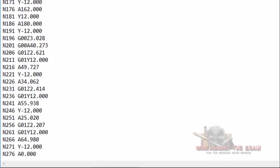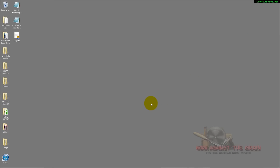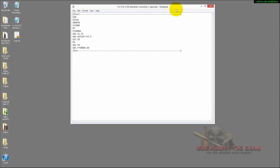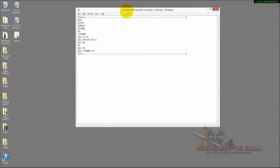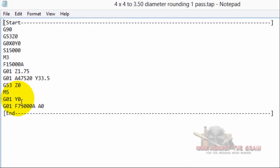I've been experimenting with writing my own g-code, spending time on the CamMaster forum at camheads.org, talking to other users and posting questions about g-code. I created g-code to take a four-by-four square block to a three and a half inch diameter — doing it in one pass. Instead of 811 lines, we're doing it in roughly 17 lines. Again, this works on my machine; I can't guarantee it'll work on yours, but if it helps you, great.